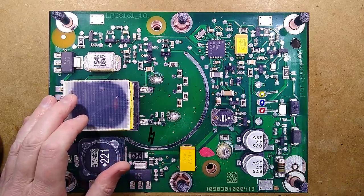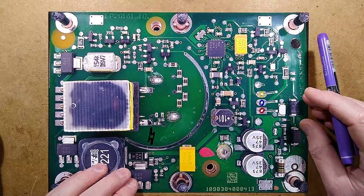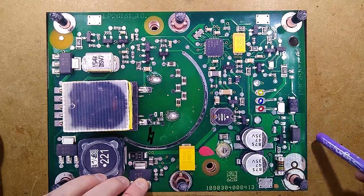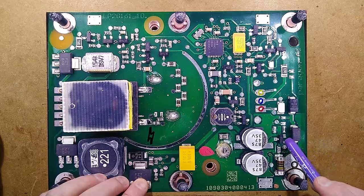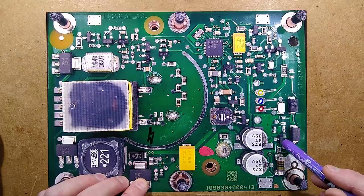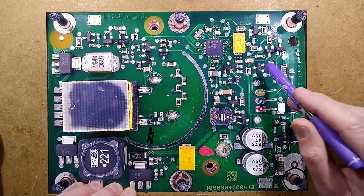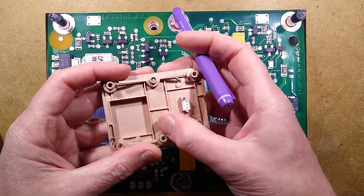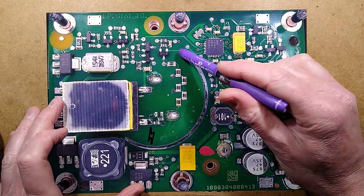Some reverse engineering has taken place. I've guessed — and this is just a guess — that this is the positive because it's going through what appears to be a fuse and then through a diode, and there's a suppression-type transient absorption diode between the negative and positive. The negative goes straight to all the negative points. These pads make connection with springy contacts, and this conductive screening element couples onto those pads.